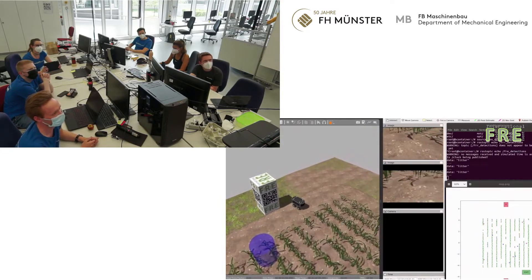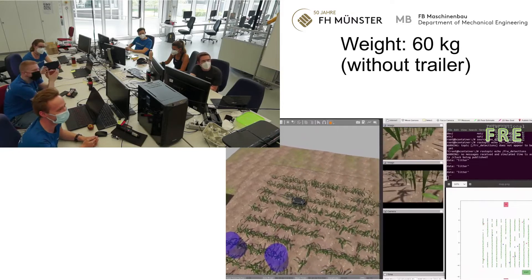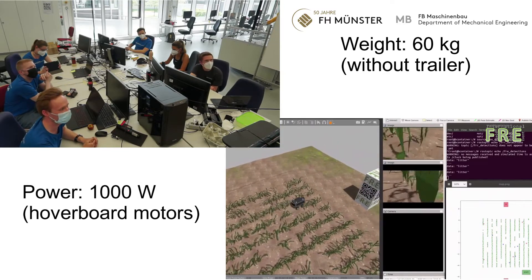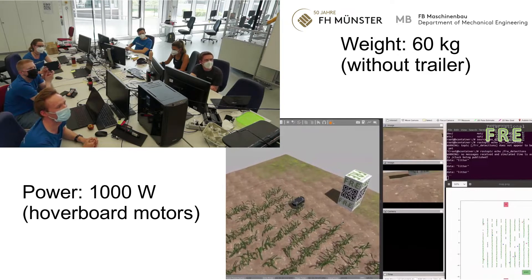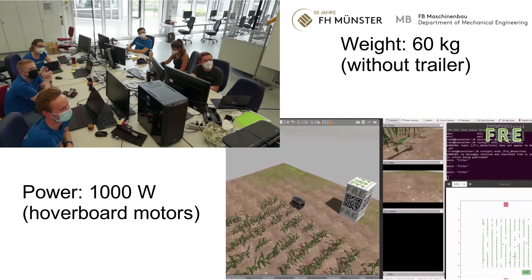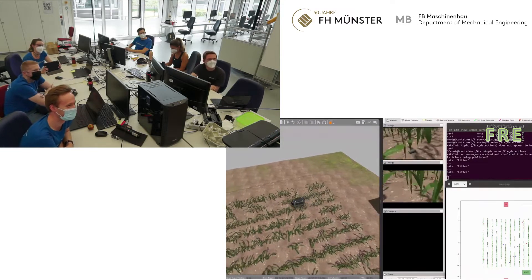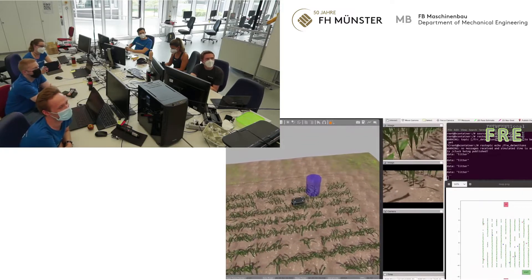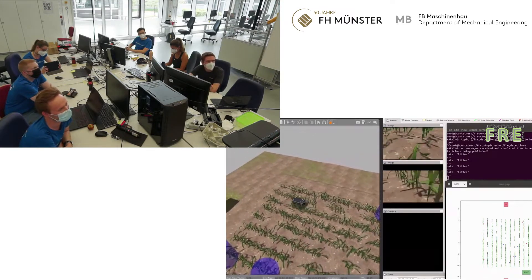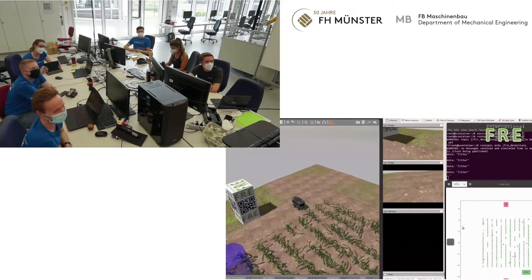What is the weight of the robot? It's about 60 kilograms. That's really heavy. How much power does it deliver? It has around 1000 watts with hoverboard motors. These hoverboard motors weigh in total 20 kilograms, so they are very heavy. Our first robot didn't have much power and we didn't have much speed, so we decided we want enough power and enough speed for every task that may come. So we over-dimensioned it a bit.